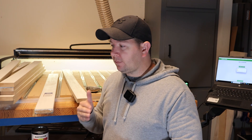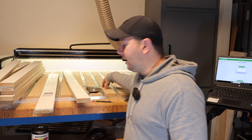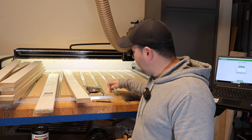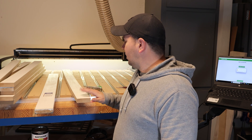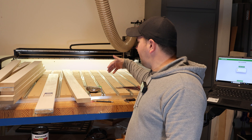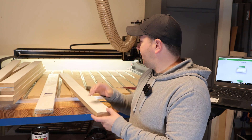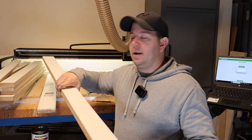Last night while I was looking around, I did find a PDF — I'll link that in the description. It's a PDF schematic for these slats with hole locations and hole sizes, because there are two different sizes since it's countersunk for the Allen head screws. I went ahead and made a file in Vectric to cut this. So now I'm setting up stops and fences so I can just plop one in, run it, take it out, plop another one in, run it — that's the goal.